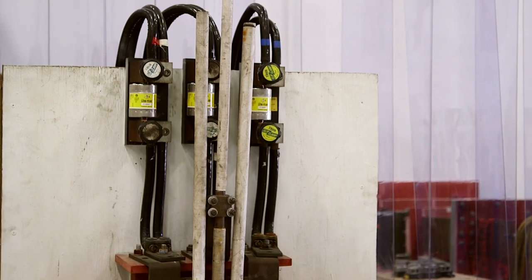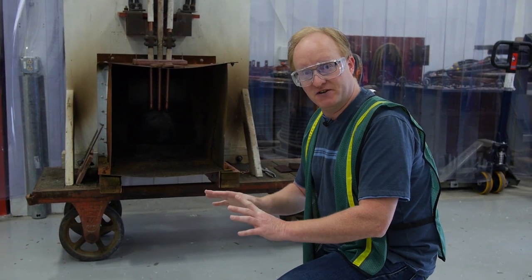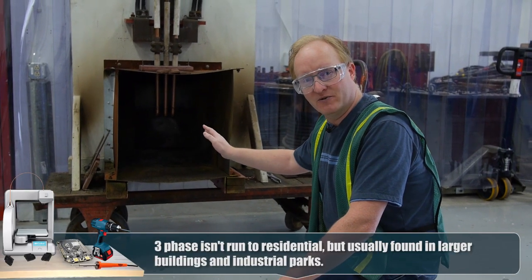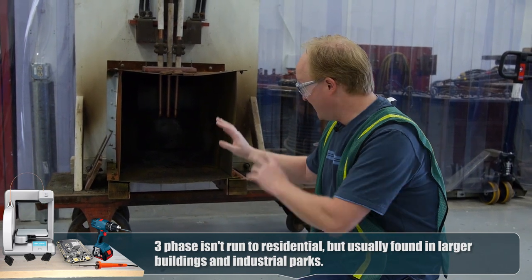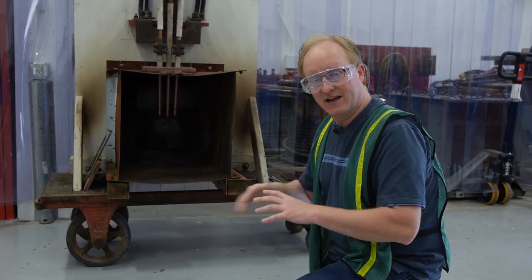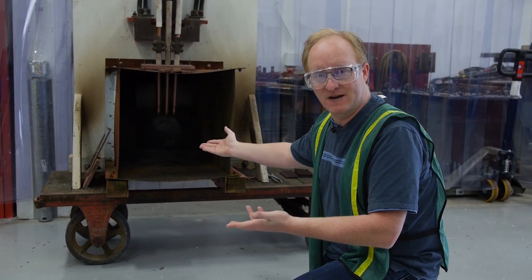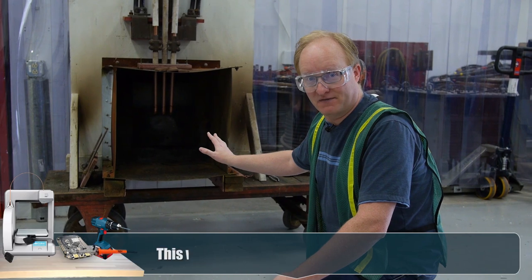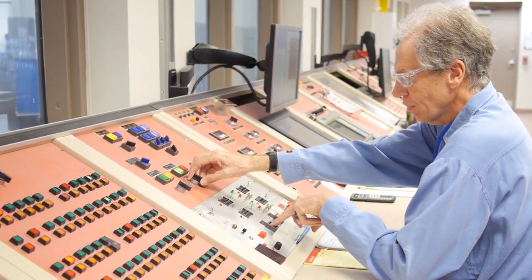This is the arc flash event test chamber. This is going to be testing a short across three-phase power — three-phase is what you have in large factories and power lines overhead, way beyond anything you might come across in the home. It's going to be a dead short with copper wire wrapped around all three phases, and this is going to be pretty catastrophic — it's actually going to vaporize the copper. The danger isn't just burn or electrocution; it's also the vapors you might inhale, like gases and copper turned into vapor. A lot of things can go wrong. Three, two, one, fire.